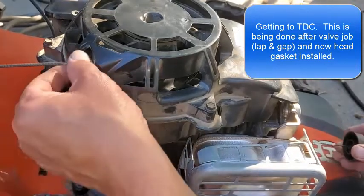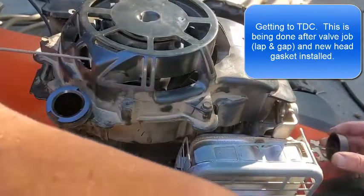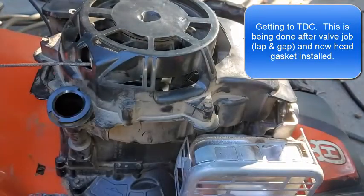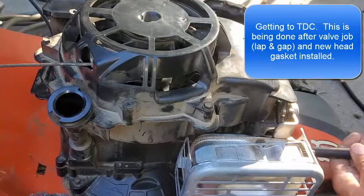It's gonna come down - watch the dipstick go down. I'm just using this as a guide to see where the piston is. And coming back up to the top, stop travel - that should be the compression stroke. Blow in there.